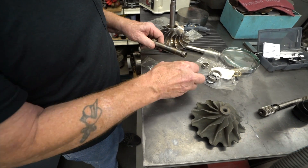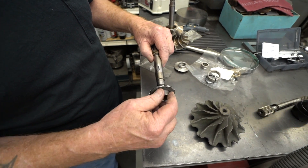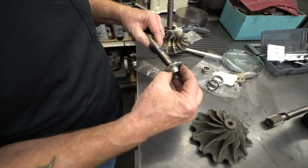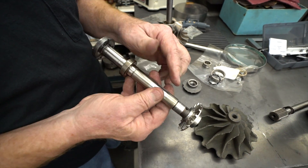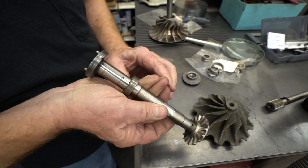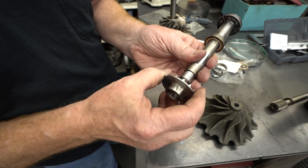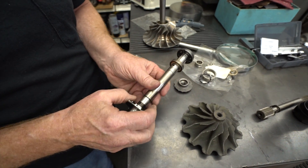Your ball bearing would be here and it would be pulled through that. And the oil slinger nut — when it's all in place — what it does is the oil comes in and hits the back here, and as this is spinning it's like a fan blade, throwing it all out in a different direction. I'll show on the compressor housing in a minute how that actually works.